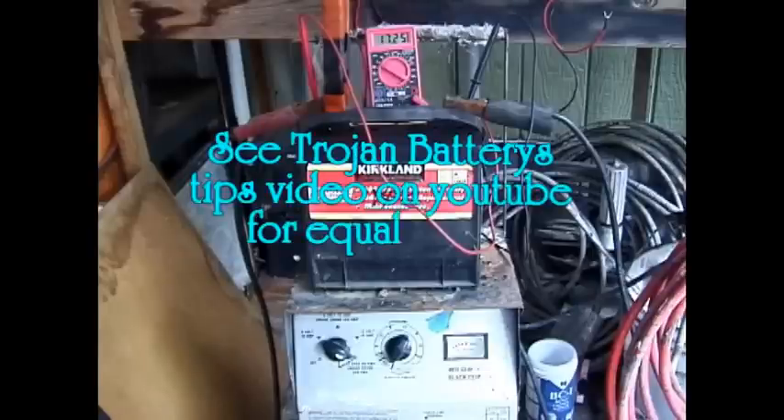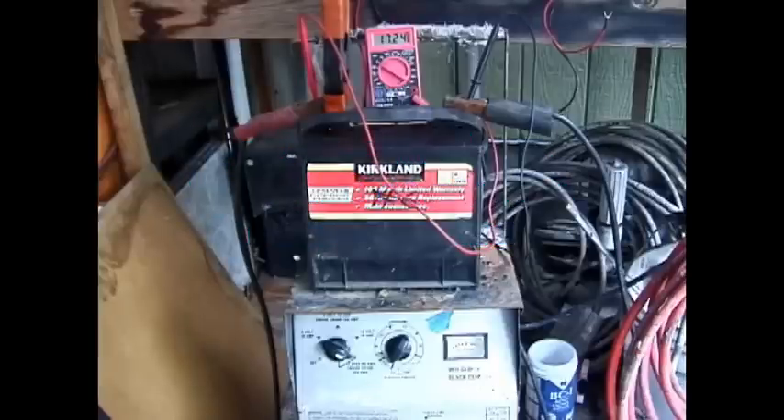The charger or solar panels are applied to the battery to get it to the required voltage to start the cells gassing and boiling, which will be above 15 volts on a 12-volt battery. High voltages will push electricity into a lower voltage battery, and sometimes high currents will also be pushed in. This causes heat, and heat must be avoided — if the battery gets warm, that is fine, but stop charging and let it cool if it gets too hot, as it can destroy the battery. Equalization is complete when voltage is high but amperage is very low — less than two amps — with almost no heat produced.